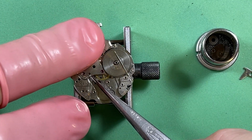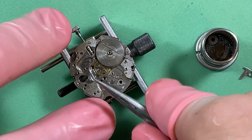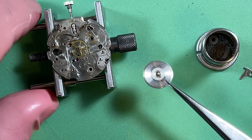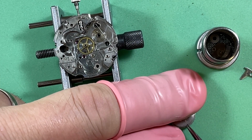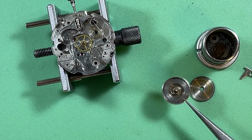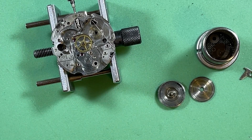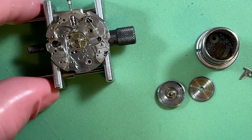Mr. Fly, I'm gonna get you. Wow. What are we gonna find here? Ooh, wow, look, it's a twofer. Wow, not only is the lower mainspring upper port roasted, but look at the mainspring barrel is snapping open. Look at that. Yeah, it's not even closed. It's not a good sign when these things pop open. It usually means that the mainspring is jacked up and it's twisting sideways, or that the barrel interlocking lip is bad. I'll have to look at that. We might have to address that too, because obviously having the mainspring barrel come apart in a watch is not ideal.